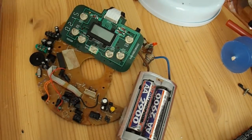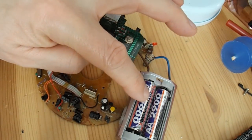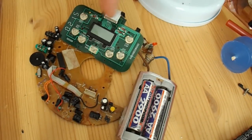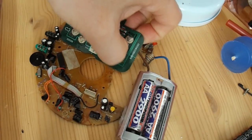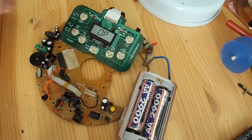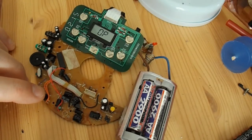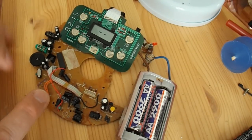So I thought, I wonder if it would work if I just put a normal battery container back in there. So I've jumpered these two AA batteries onto the normal terminals and reconnected the little display. If I press play, you'll see the display works — it's actually saying OP for open. If I press the switch here that detects whether the lid's up or down, you'll see that works OK. It's trying to detect how many tracks there are at the moment but obviously there aren't any because we haven't got the rest of it connected up.